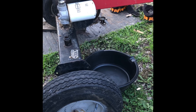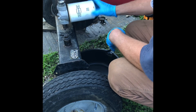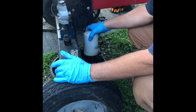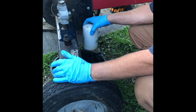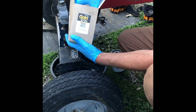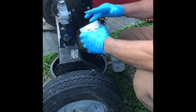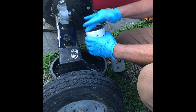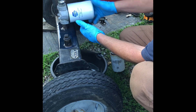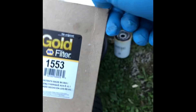Let's take that oil filter off. That's a cross 25 — my guess, this is probably the original oil filter. Not too tight. The fluid looks decent, which is good. That's clean, clear fluid — I'm not seeing a lot of water. I'm happy with the NAPA Gold Filter 1553. That's something I can get a part number for and find again easily. I always smear a little bit of oil on there. I'd normally put oil in it, but since it's sideways, it's kind of hard to do that. See it here — 1553.